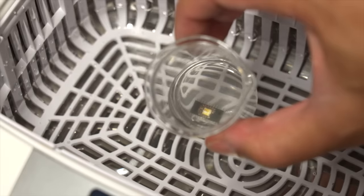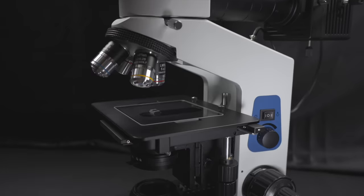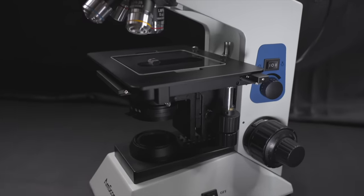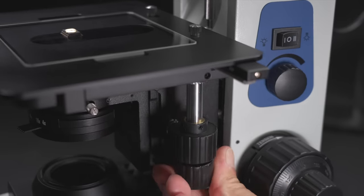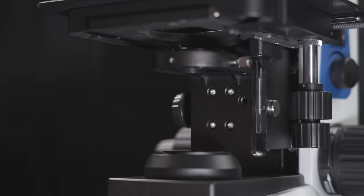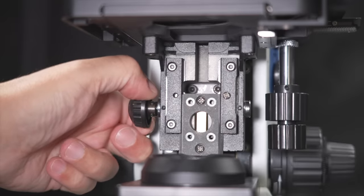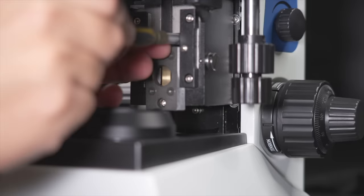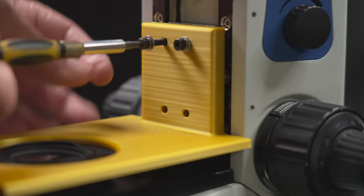This is an Amscope metallurgical microscope, but it didn't come with this cool automated platform. It's capable of transmissive and reflective microscopy, which means it can shine light up through a slide to look at transparent material, or down through the objective to illuminate something opaque. Let's remove this manual stage and install the automated delta stage for finer control and the ability to create large stitched images of our microchips. With this, I can take a ton of super close-up pictures and then use software to stitch all of them together to create one mega image.